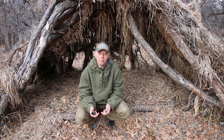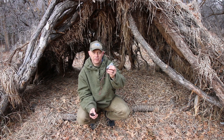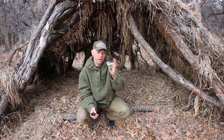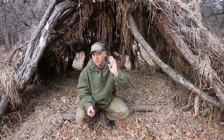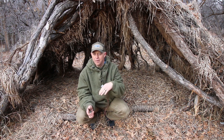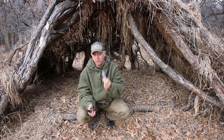It really depends on the coarseness of the stone. This is a very soft stone, so it's going to be more for polishing or finalizing. If you have a really messed up blade, you might want to start with a rasp or a file. Then if it's only a little bit messed up, you're going to use a more coarse stone. But if you're just maintaining it, you're just going to use a soft stone, which is something like this.